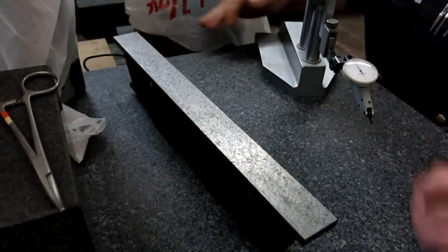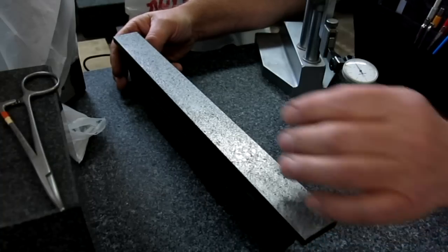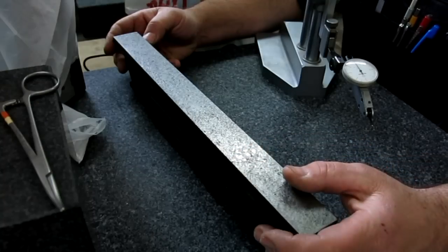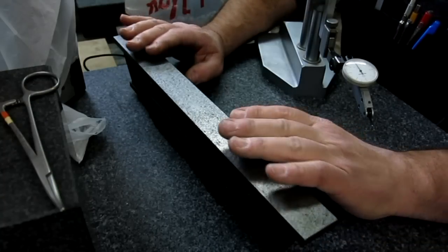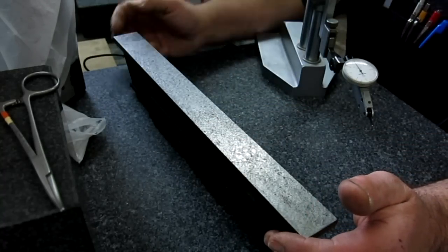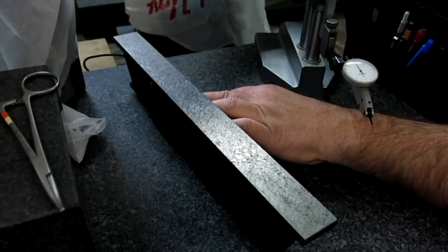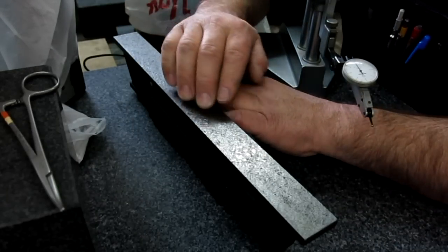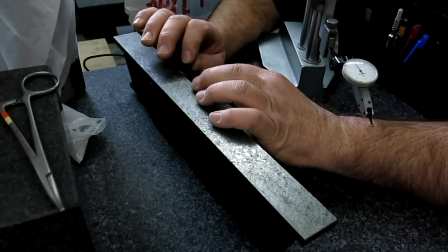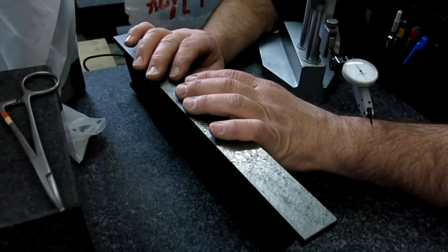Okay, so here's the level, and this is the surface I scraped here. And I mentioned earlier, you saw some of the clips of me scraping on this thing. This was very heavily corroded on the bottom, and I think I showed this in a much earlier Meatloaf episode. My current belief is I really need to take some more material down. One of the issues was the material I was scraping off was kind of, I want to call it crumbly.